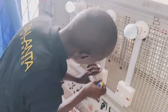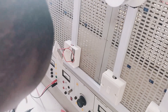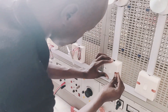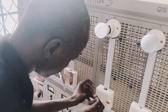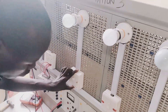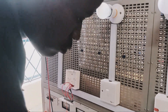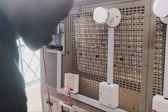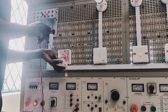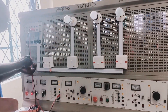I've already done my termination and I'm sure of what I'm doing. It's good that you test, but remember we also have a unit of testing electrical installation systems — we'll be doing that as time goes by. It's good to test your circuit before you do the final fixing. Once you've tested your circuit, it's okay to power it. Remember, don't power a circuit that you're not sure of — you might end up damaging the whole system or even the whole house. The final fixing is done. The looping of the two commons to power both gangs is okay.